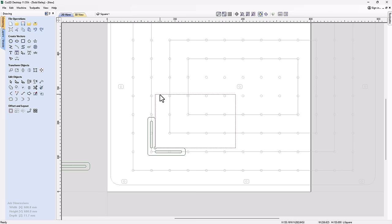Now there's a hold that we can make that will apply pressure left or right, to the sides, to the edge of your material, as opposed to an actual hold down where you're applying pressure to the top of your material. One thing that's nice about this sort of hold is that they're not really proud of your material generally, so you get a little bit more clearance across the top. They're nice because they're easy to loosen, pop your material out, and pop another piece on that's the same size. So if you're doing production stuff, these are great for that.